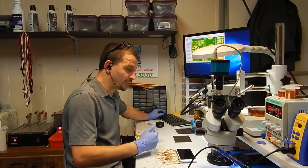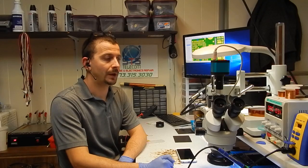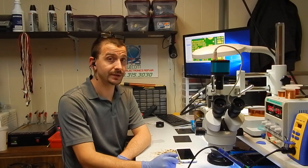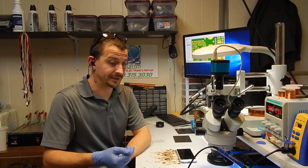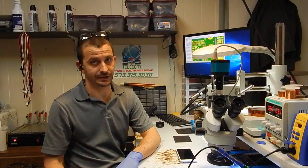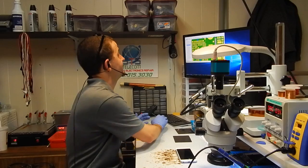A lot of times when this previous repair stuff comes in, you wind up fixing the main problem only to figure out why they had the screws out of it to begin with. Like if an iPhone 6 Plus comes in here for long screw repair, it's automatically getting quoted for touch IC repair and long screw repair, because after I get done fixing the long screw damage, I'm going to find out it was long screw damage because somebody was trying to fix touch disease. So that's the feeling that I'm getting from this 6S Plus.